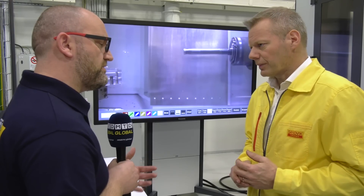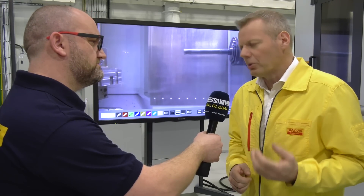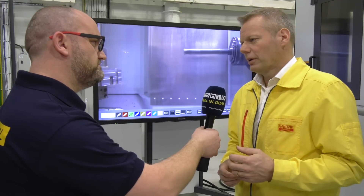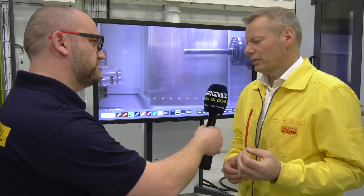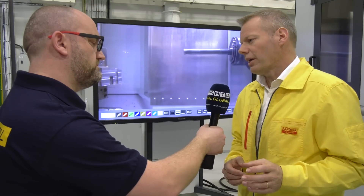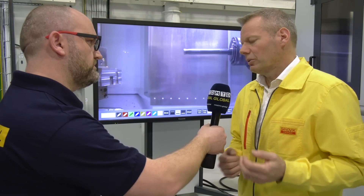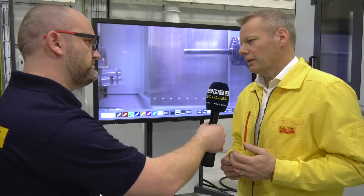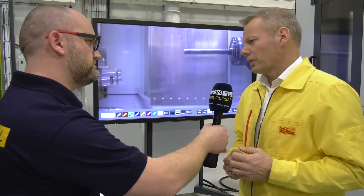And why does having a lightweight cutter — how does that aid the machine in process? It will really boost the performance when using silent tools adapters, because the weight in the front of the silent tool adapter, as well as the length between the cutting edge and the damper, really comes into play to be able to increase the productivity.